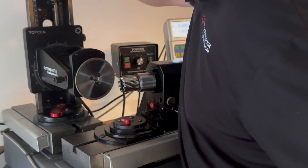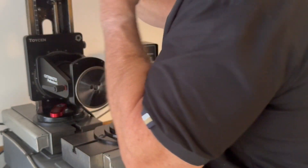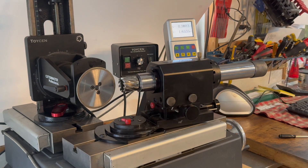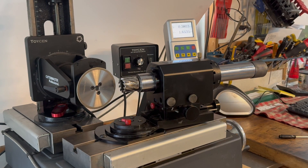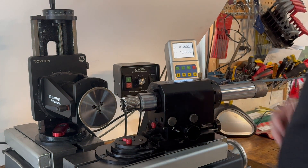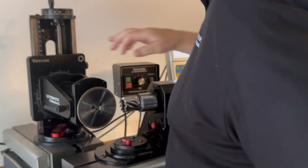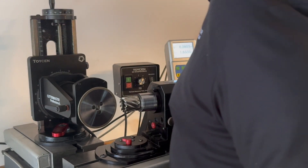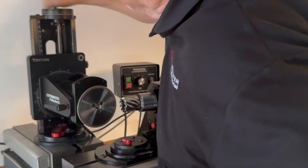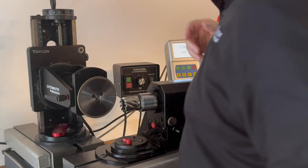When you're using the JX, there's a scale here, or there are marks on the casting. You come around here — this is a zero, right about there, so where the set screw is is zero. It's 200 graduations around this thing, so each graduation is a half-thousandth. That's a 10-pitch screw. When that is at zero, this spindle is about center. So we want to come up about an inch — 10 revolutions — and stop at zero.